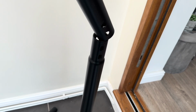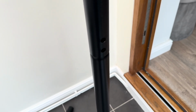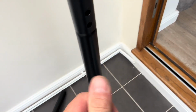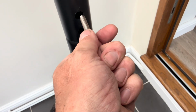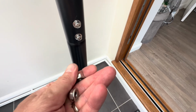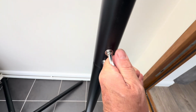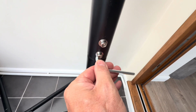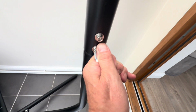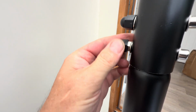So now we're on the last piece of tubular ironmongery for the chair, and we'll just slot that on like so and align these holes for the bolts. So we've got 2 long bolts here, and they're going to have to go in there. I'm going to put a washer on them, and then these 2 nuts combined with a washer for the back, and tighten accordingly. And then cover the nuts up with the caps.